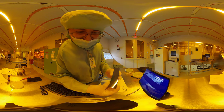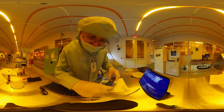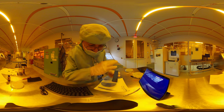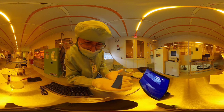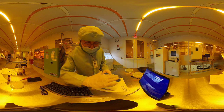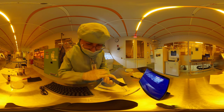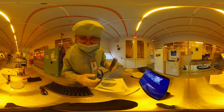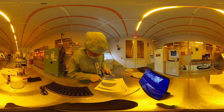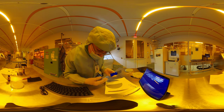Now we have this long piece of silicon wafer ready to be used. Normally, if I was gonna use this for depositing materials — metal and things like that on this substrate — what I would do beforehand is actually put a layer of photo resist material, like a polymer, that's gonna protect it as a temporary protective layer so that none of these microscopic pieces of broken silicon scratch it.